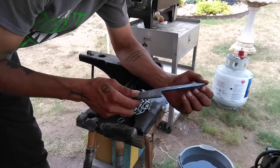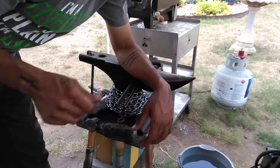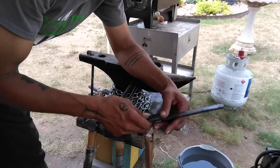Taking it up to about 1600 degrees, I pull it out of the forge, then hold it with my tongs and wave it around in the air — let it air cool down to 800 degrees.